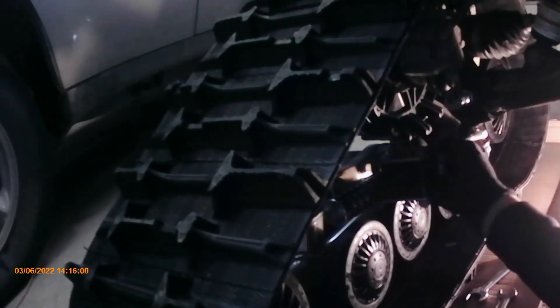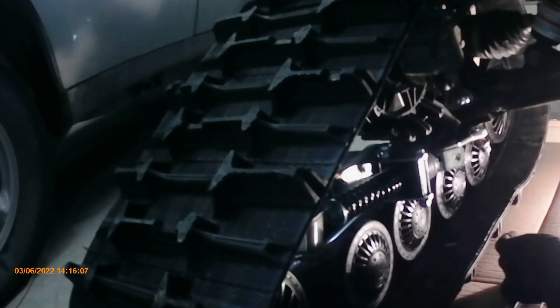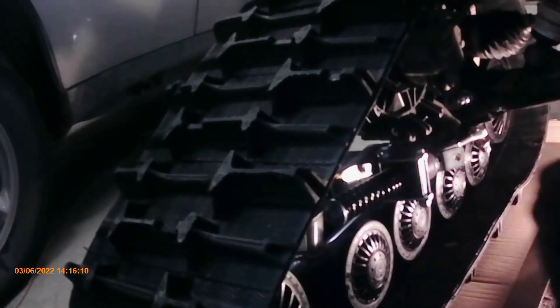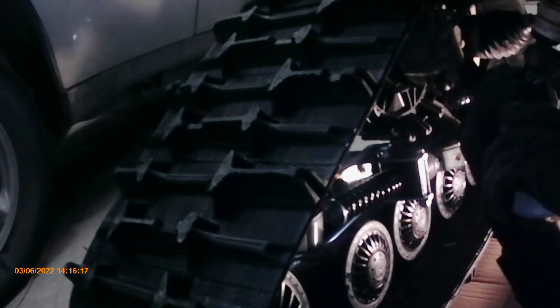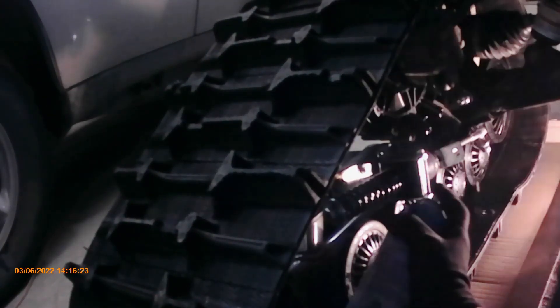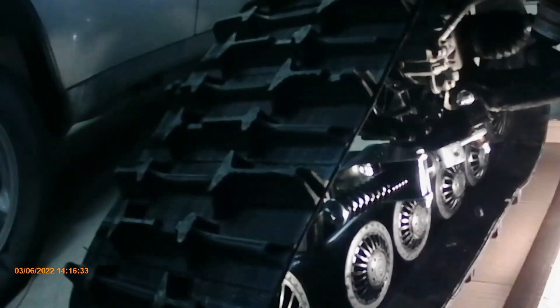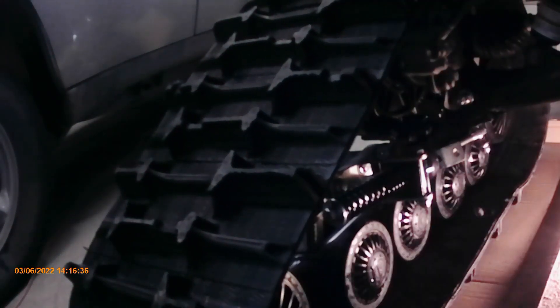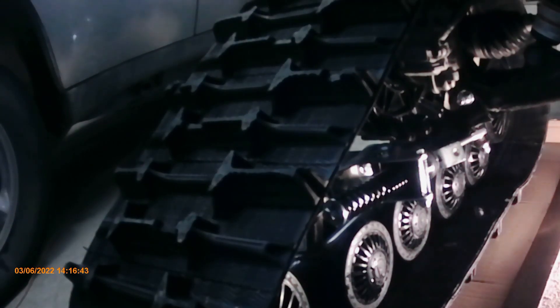One thing I forgot to mention — these tabs are for anti-steering lock tabs, which you don't need on this machine because it's 2015 and higher. I'm going to make sure this is on the inside on all four tracks and then tighten this up — about 30 foot-pounds, just snug it up. If you over-tighten there's a chance you could strip these threads and they warn you about that in the instructions. I've already done the track tension here. I'm going to spray this ball joint and the track tension adjustment bolts just to protect them from corroding.